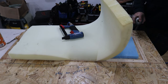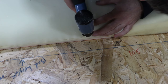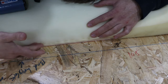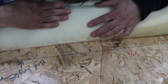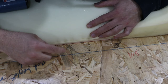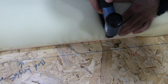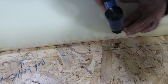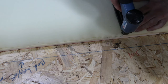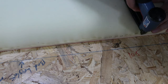I'm just going to glue this end as well. You can see I'm finishing on top, then I'm going to use a thick dacron over that to get rid of all the tack ties — you don't want to be seeing them on the fabric. The thick dacron comes over the top and finishes on the edge, so when you staple on you won't see any ripples. This is a two-inch medium soft foam — you don't have to use hard blue on a headboard. This is plenty fine.